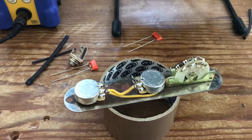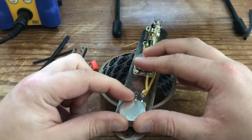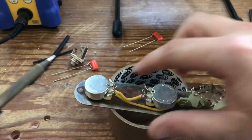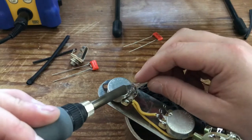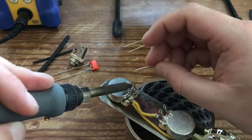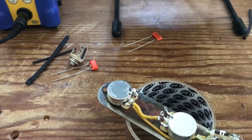As I said at the beginning of the video, we need to ground this lug here. We do a separate video on how to ground lugs — there are two ways of doing it. The way I always do it is just to fill the eyelet with solder and then ground it to the back of the pot. The other way is to put a bit of wire through the eyelet and connect it to the back of the pot — it does exactly the same thing.